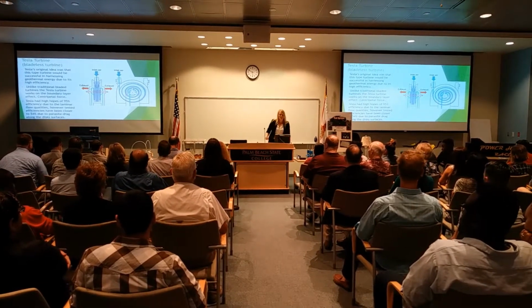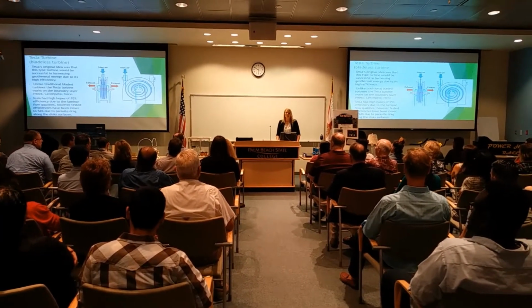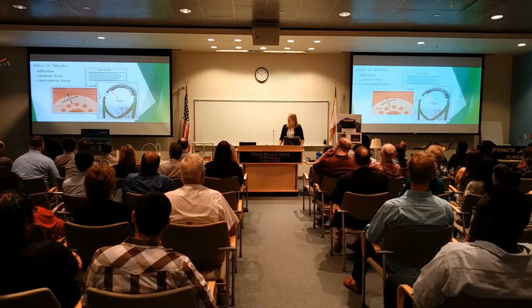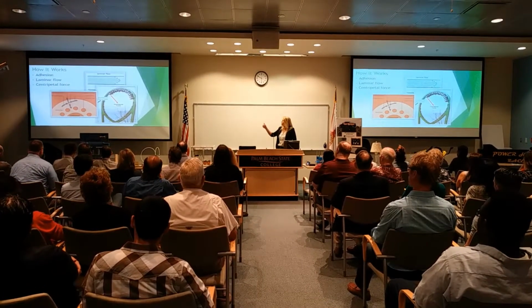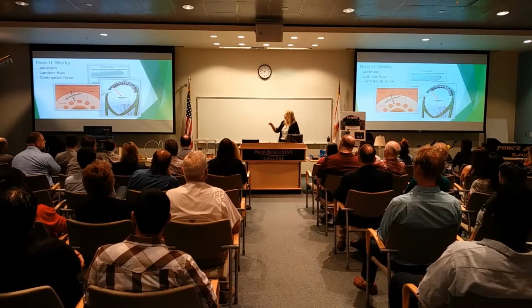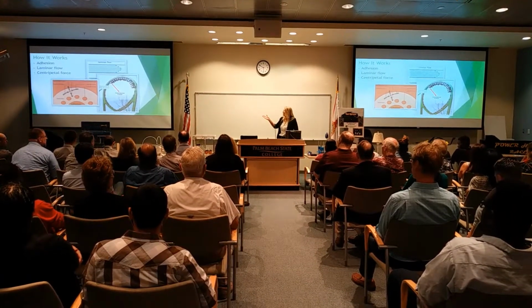What it works on is adhesion and laminar flow, whereas a lot of traditional turbines actually run on turbulent flow, which is far different than what this design does. What adhesion is: when the air molecules land on top of the disk, they actually try to flow towards the inside through centripetal force of the disk spinning. They're impelled, and the molecules are sent towards the center of the disk. A lot of us feel this on roller coaster rides.